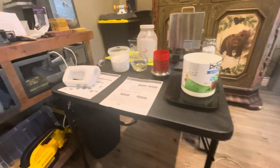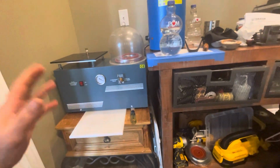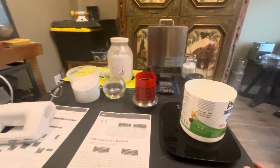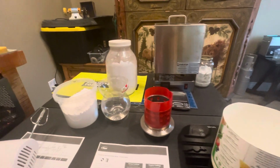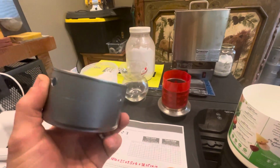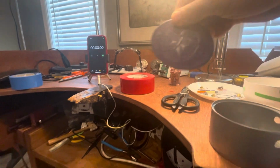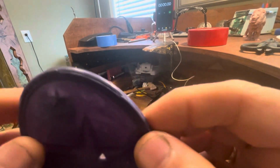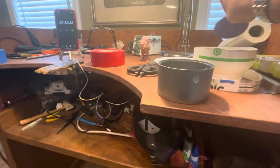You could use, I guess, masking tape to mask off your flask. You can see how new my flask is. I've never done a casting before with vacuum. I'm going to do it with this machine in a later video and burn out with that oven. I'm planning to collect my wax, because it just takes so much longer to get rid of all that vaporized wax, and people say you can reuse it. Not really planning on that because it'll be mixed up with sprue wax, which is different than the wax I'm using. Supposedly it's a carvable wax, and it's kind of fun because it's not like standard injection wax where it's just too sticky to carve or adjust, so that'll be fun.